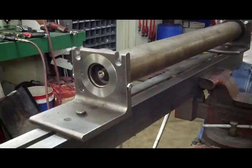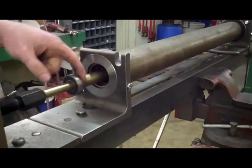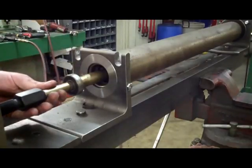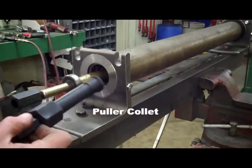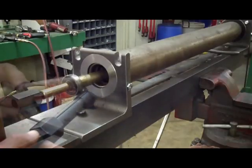Swap ends with the roller and slip the shaft back in from the other end. If this bearing were to come apart and leave the outer race, use the puller collet to expand it inside the inner groove of the race and pull it out.